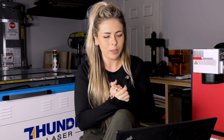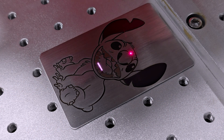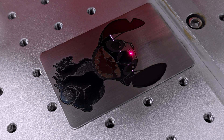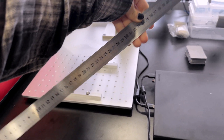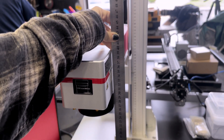Every laser is different, and after running my material test card that I copied off of YouTube, it looked nothing like the one I copied. That's okay — I wasn't surprised, it was my first one. When it comes to colors, making small changes in the settings or the focus make a huge difference when you're engraving color. To keep it more simple, I ended up using different frequencies and intervals on most of my test cards. Your focus also has a huge impact on the color, so be sure to use a ruler or a focus stick to ensure your focus is at the same height it was when you first made your material test.